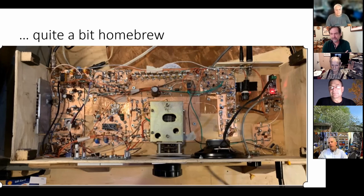And maybe even play around with the pot that you have going in there, the pot input. You might need to put some more resistance in there, so it has to go through more resistance before it gets to the LM386. You're basically just changing the range of your AF gain control.